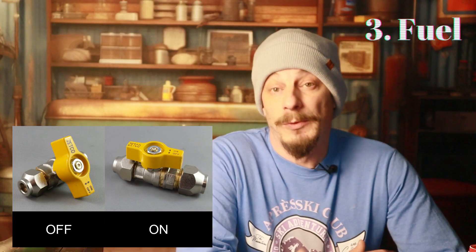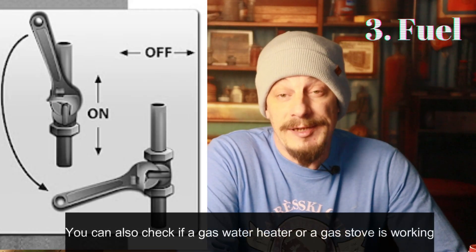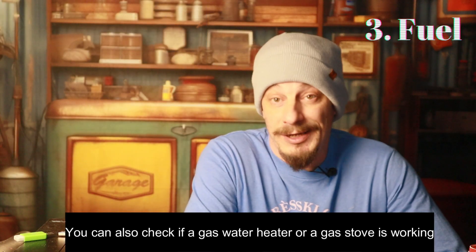You also want to check fuel — make sure the gas valve is not off and the meter itself isn't shut off for some reason. It's very easy to jump straight into diagnostics looking for something wrong, spend 20 minutes thinking it might be a gas valve, when the real problem is you don't have any fuel. So when you check these three things first, then you're ready to proceed into the furnace to start doing actual diagnostics.